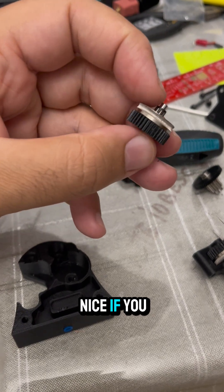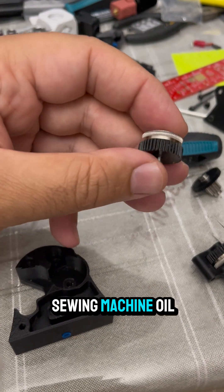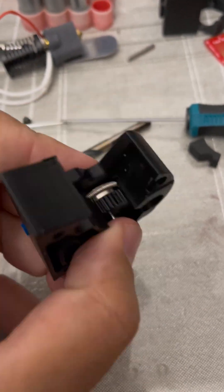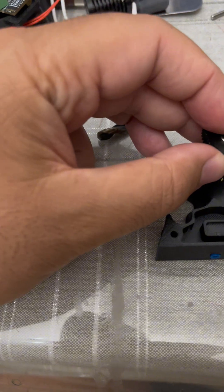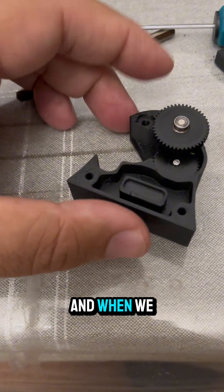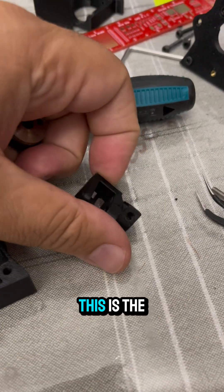After that we will take the gears and install them. It will be nice if you lube the bearings a little bit with sewing machine oil. The first gear is inserted like this. Now let's insert the main gear, which has one bearing here and one here — it inserts like this, and when we turn it, it turns the other gear as well.